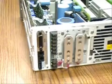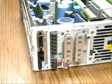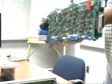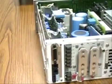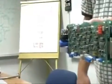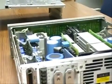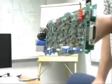An important note: customers with older revision boards using two-board sets — these are not backwards and forwards interchangeable with the newer single-board units. The newer single board has more capability, which was part of the reason for the change. The rear chassis must be changed if you try to put the new board into an older instrument, and the bias transformer also needs to be replaced. Agilent continues to support both the older two-board set and the one-board GPIB interface.